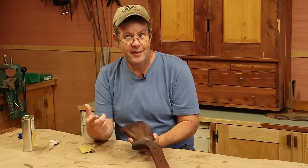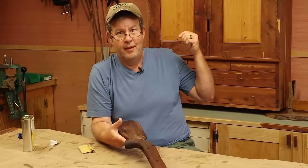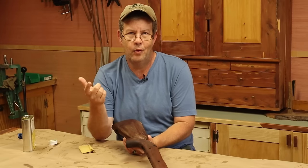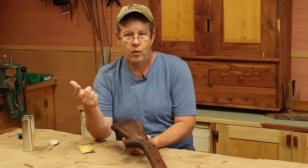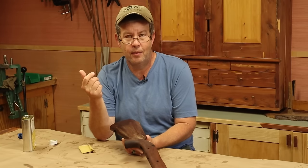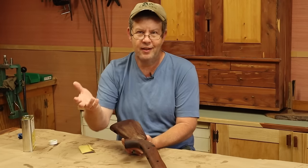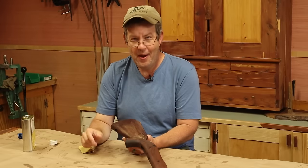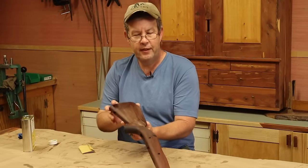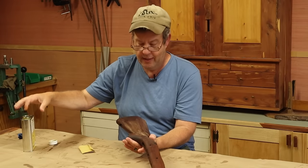With your oils there are so many to choose from. Mark in the comments made a similar point — he's a huge fan of tung oil. I mentioned this cabinet behind me is tung oil; I kind of like it myself. Mark Novak, who does the Anvil videos, does outstanding work and he's a big fan of Danish oil, which is similar to tung oil. There's also true oil — I've always heard true oil was just a version of linseed oil with some additives to help it dry quicker, but I was recently told it's not even really an oil. For a working field grade firearm, boiled linseed oil is what Mark recommended, and I agree — this is a working field grade firearm, so boiled linseed oil I think is the easiest to maintain.